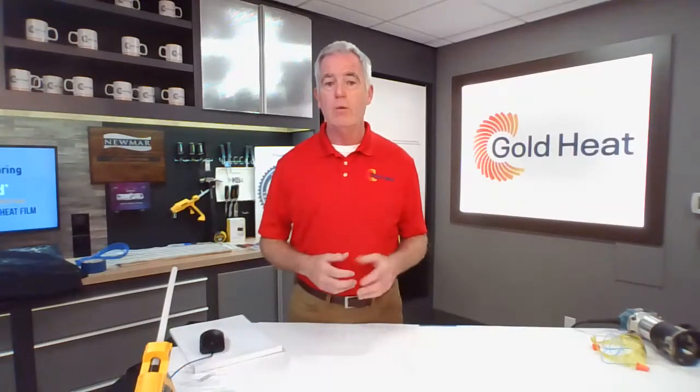Depending on the finish, whether it's a PVC, which is a lower level finish, or a urethane finish, they can be easy or hard to clean and yellow over time or not. For my money, it's worth every penny to go from a PVC to a urethane finish if you're looking at some type of a sheet flooring.